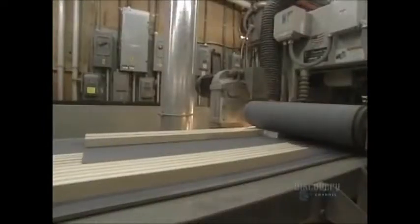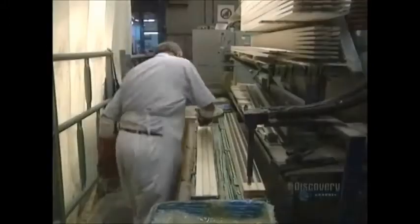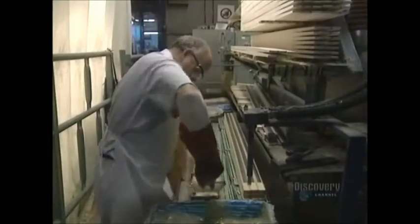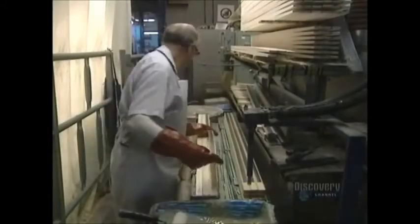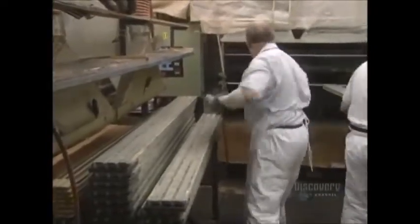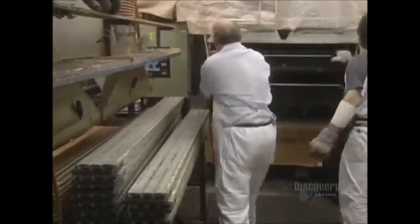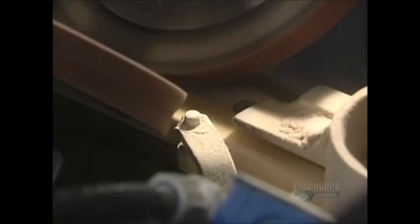The shafts are then moved to a precision sander. The shaft has to be reinforced with fiberglass. With a roller, they apply a coat of epoxy resin, a kind of glue, onto which they place carbon-reinforced fiberglass. The resin has to dry and harden. The stick shaft is placed in an individual mold and cooked in this press heated to 80 degrees for 12 minutes. The shaft then goes to a milling machine equipped with diamond-headed knives which round the edges.